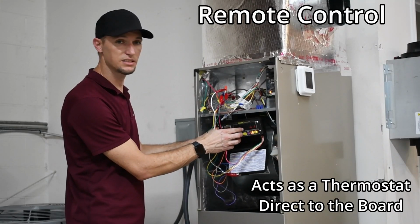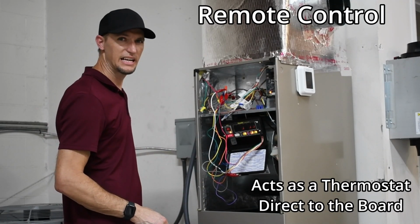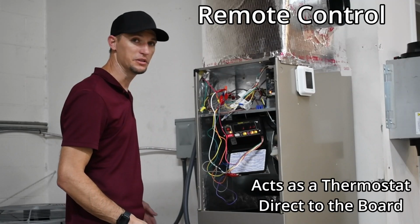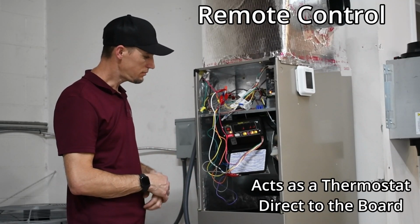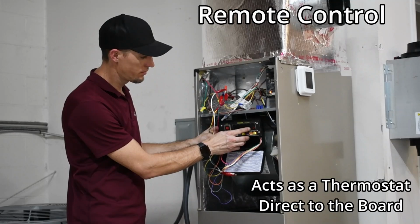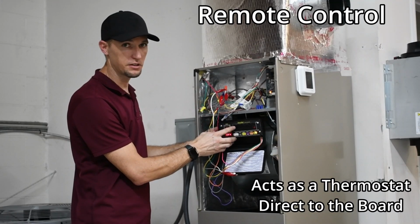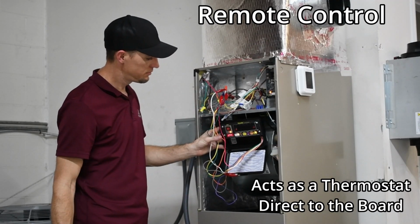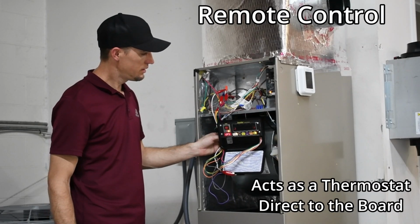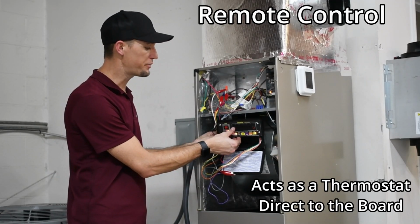Then your next step, I'm going to test cooling. And then the condenser has a 5-minute delay on it, so you would have to wait for your delay time to expire, and then the system will activate. And then lastly, you can also test, this system doesn't have a heat kit installed, but you'll hear the blower motor ramp up based on this test. So in other words, this would activate your heat strip, and then you can verify whether everything's working appropriately.